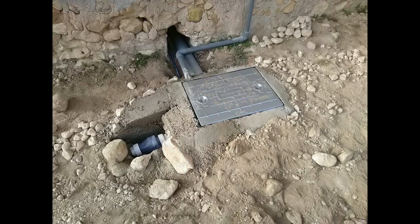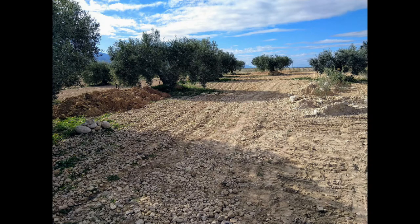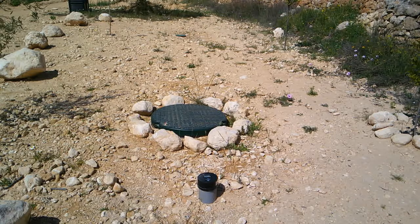We put all this in with a manual inspection cover, basically just concreted it in and put the inspection covers on. Then it was just a case of backfilling all the trenches and making it all look nice — you'd never know we'd been here. In the foreground the nearest is the breather for the septic tank, which has a carbon filter on it so no smells emit. Just behind that is the bigger main access to the tank for emptying, and in the distance you can see the access cap for the soak away.